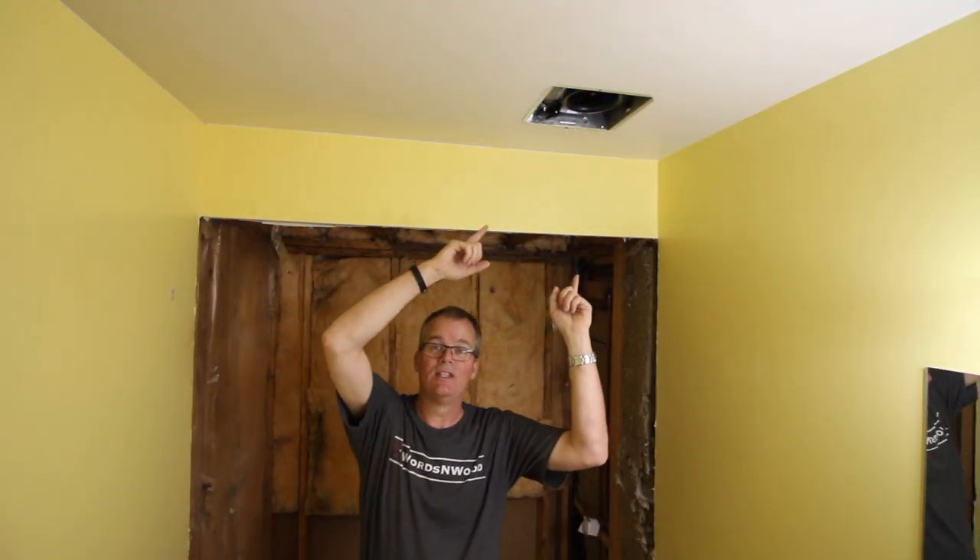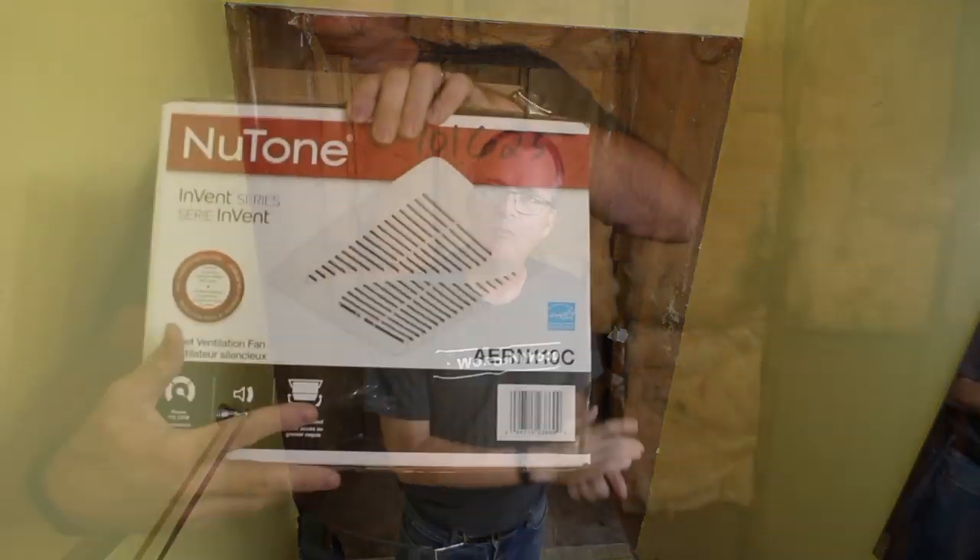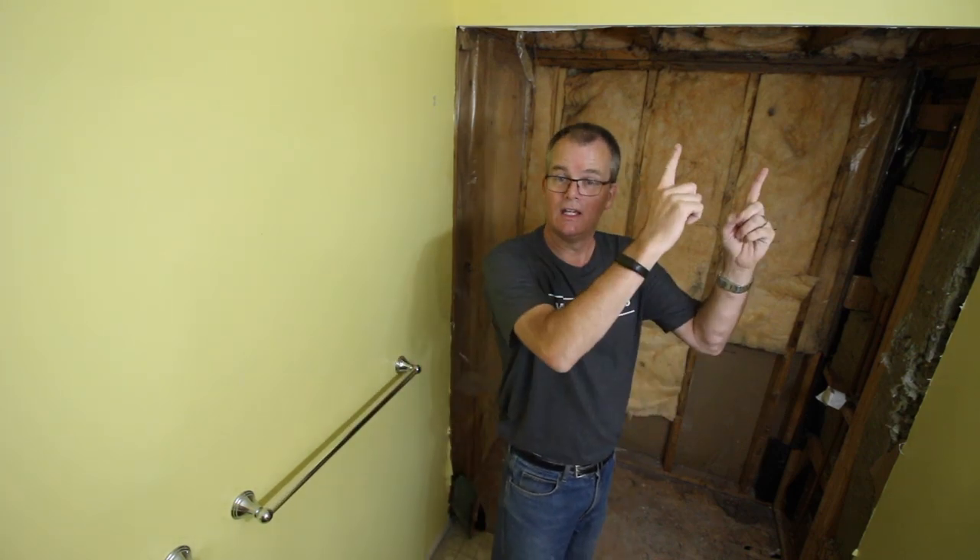So the last bit of this story for this update is the exhaust fan. The exhaust fans in our bathrooms have always been a bit underpowered, so I wanted to replace them as part of this renovation — they're 35 years old, just like the house. I watched some YouTube videos, checked some recommendations, and went out and bought a nice fan: 110 cubic feet per minute, low noise, and get this — you can install it from down below, no need to access the attic. However, when I started to install it I discovered that while maybe I can install the new fan from below the ceiling, there is no way I could remove the old fan from below the ceiling.